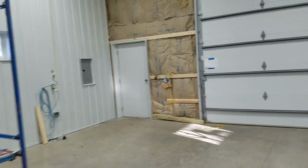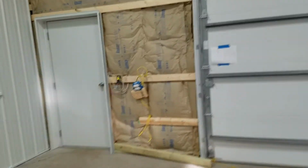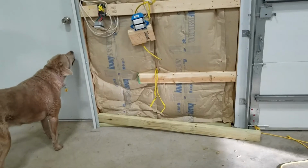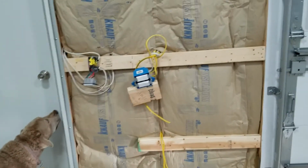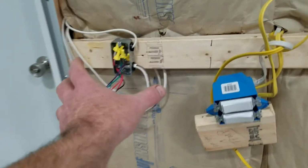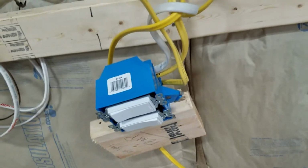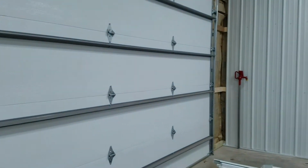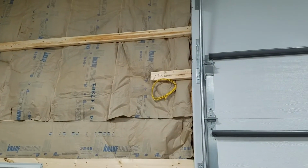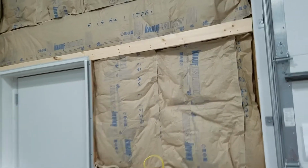But tomorrow morning, Jeff and I will get that wall sheeted and the corner in, and then we'll start on this side, and we will do this one, put the box down there with the GFCI for branch 2, the 2 holes and the 2 big boxes for the 2 switches for the interior lights, and the 2 switches, you know, these guys here for the exterior lights. And on that wall is 1 switch for the exterior flood. And then of course up here we've got to put in the box for the garage door opener on this side. Yeah, this has come a long way.